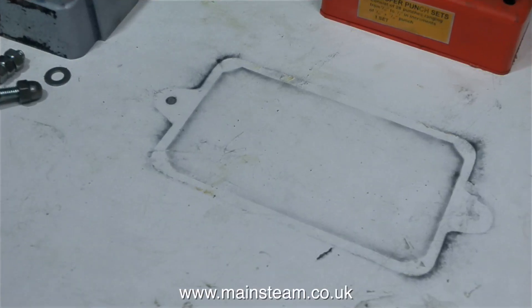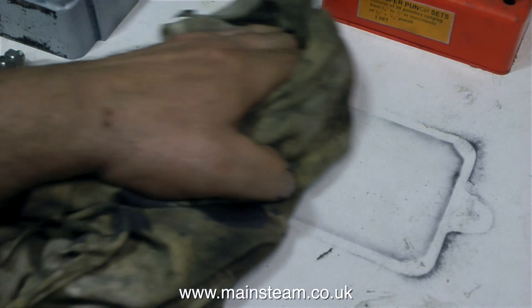What's this? It isn't what's left of the 5A box bed after being too close to a nuclear explosion - it's an impression of the box bed in iron filings on the bench. That is because I transferred the hole positions of the sole plate by using a transfer punch, and by hitting the transfer punch with a hammer this transferred the hole positions from the sole plate into a centre punch mark on the box bed. The shock of the hammer blow dislodged a lot of iron filings which are now on the bench, and as you can see I'm just cleaning them up.